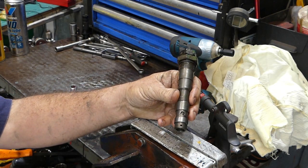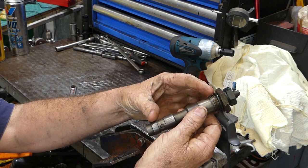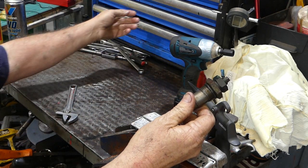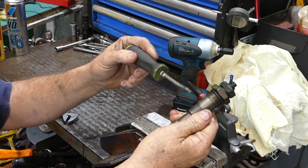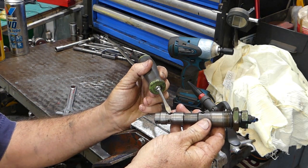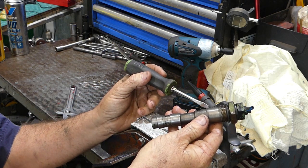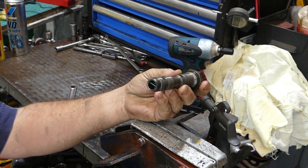The filter bypass — what it does is, if the transmission filter (that's the one under the right-hand side of your gearbox) gets blocked, the theory is that unfiltered oil is probably better than no oil at all. So the valve opens up, unfiltered oil goes to the lube circuit, and all of a sudden you'll have no steering, no hydraulics, just nothing.